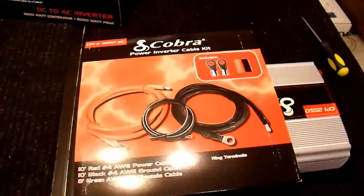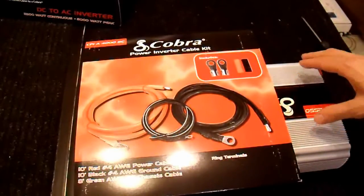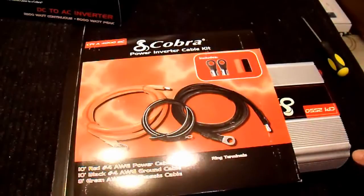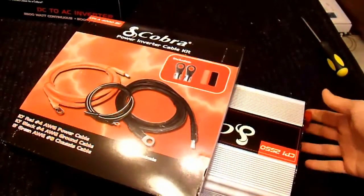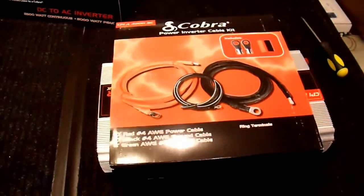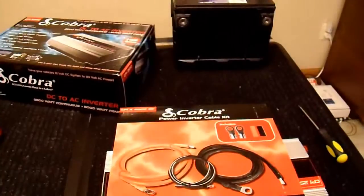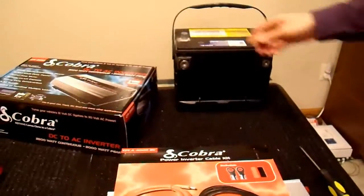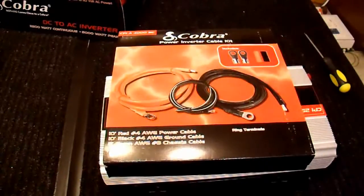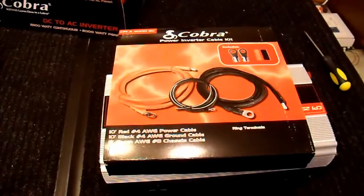So these 10-foot cables are not going to be adequate for this inverter. It's also worth mentioning that if you really want to use the full 2,500 watts this thing is rated for, per CEC specs you need 4-aught cable to carry the necessary amperage — and 4-aught is obviously not practical. They do give you two lugs, two positive and two negative, which looks like they fit about 4-gauge cable, so you could get two 4-gauge runs on it. This is 10-foot with no battery clamps on it.